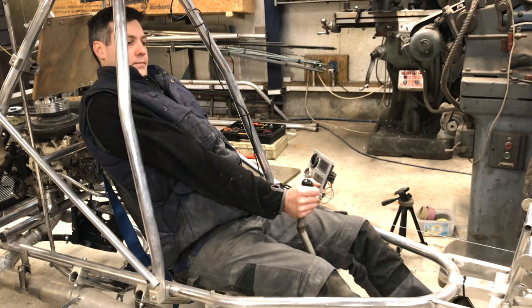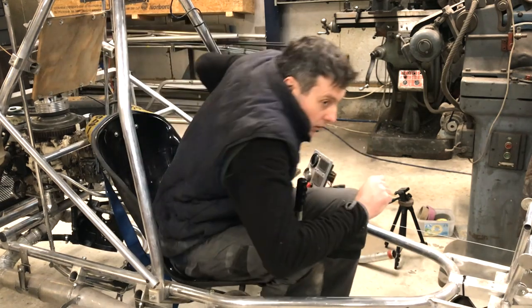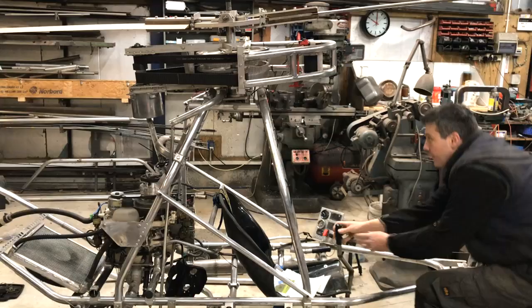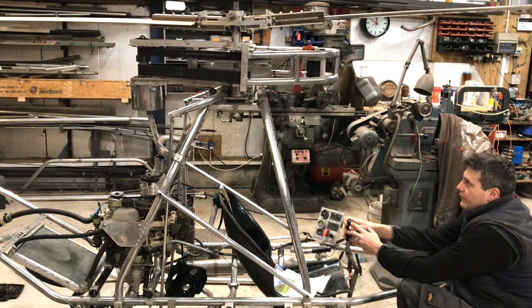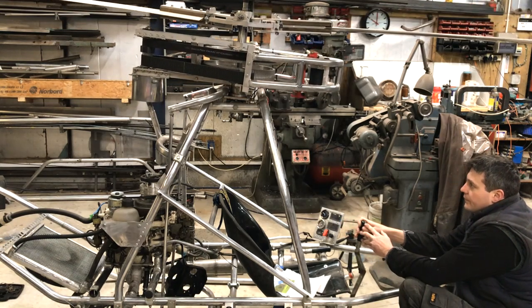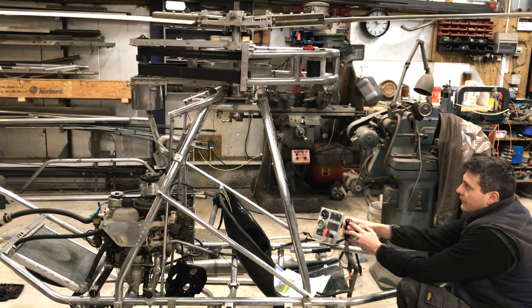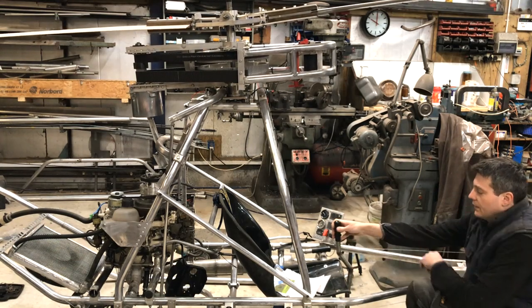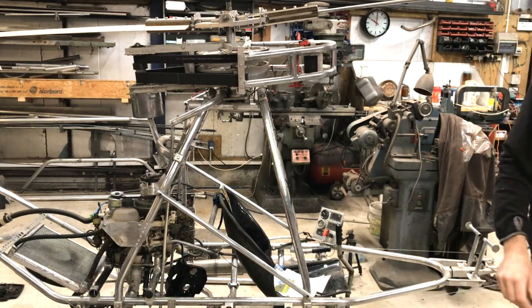Helicopter pilots are fully aware of having to push forward on the cyclic during an oncoming gust of wind or when transitioning into forward flight. If I move these hinges relative to the mast, then rotor flapback would be reduced. As a wind gust increases lift, there would also be an increase in forward rotor tilt, automatically cancelling rotor flapback.